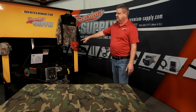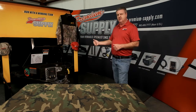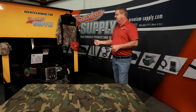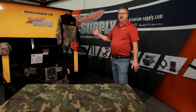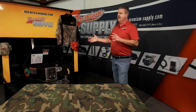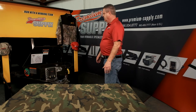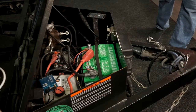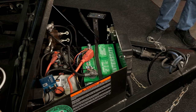You can either go with a hoist, which is the most efficient on your battery life. You can go with a direct push cylinder, which we'll talk about here in a few minutes — those aren't as efficient, but they have advantages as well. You can also go with a telescopic cylinder. Each one has pros and cons and we will talk about those today, along with the plumbing side of the circuit.